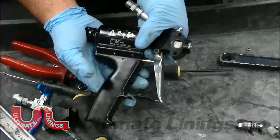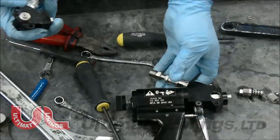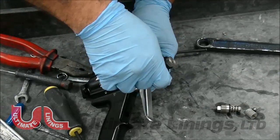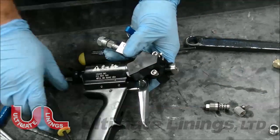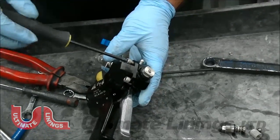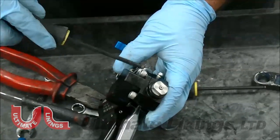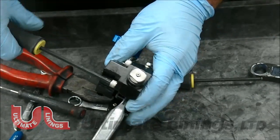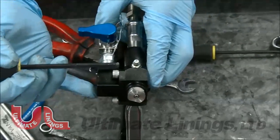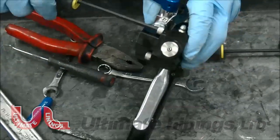That tip adjustment is really important. Once you get it corrected, push it back. Now you're ready to assemble your side block using your 3/16ths Allen. Just get it started, then torque them down tight — but don't get them crazy tight because it's an aluminum body and you'll smash the piece. Normally it's 8 foot-pounds of torque; that's it.